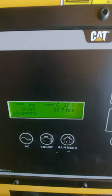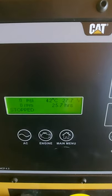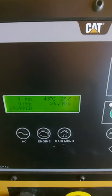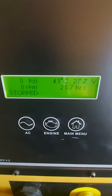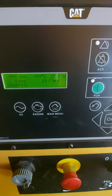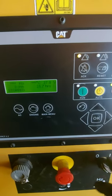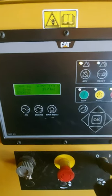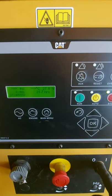If we simply switch that, it now energizes the ECU, and there we go — we've now got the coolant temperature there. We now know that the coolant heater is working because the temperature is exactly what it should be. I'll turn that back off. We like to leave them off when they're in auto so it's not all energized causing wear and stress. We have had some ECUs failing in the past, so that's how we like to leave them.